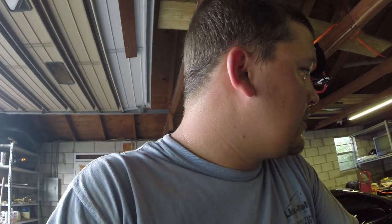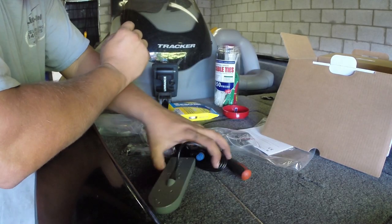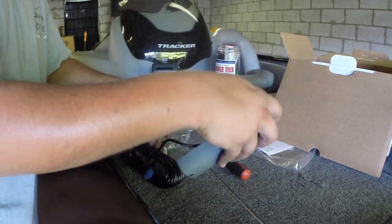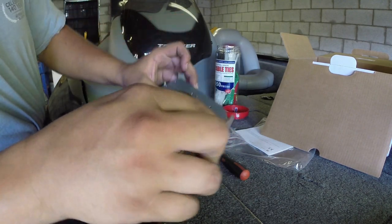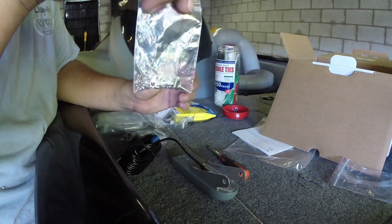So what we're going to do is go ahead and get started with the Garmin. The first thing we have to do is run the transducer line and all the power lines and stuff like that. We're going to go ahead and start with the transducer here — get the mounts and stuff on it and then run our wires. The first thing is put our transducer mount on here, which is this bracket. It has these little dowels on the transducer where you just smack it on — it goes right where it needs to be, no trying to line it up. It already comes with your hardware as well.